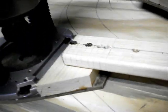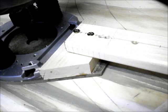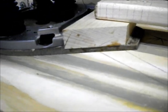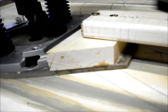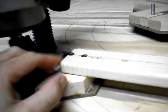One thing I saw on the internet was to have this slotted so you can get it exactly the dimension that you want. That connects to this router base here, which is just a piece of quarter-inch masonite mounted right to the bottom of my router and glued to a block that the arm is screwed into.